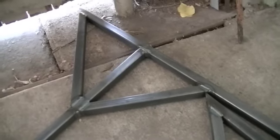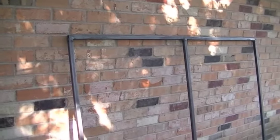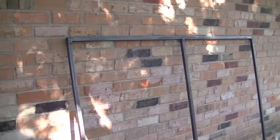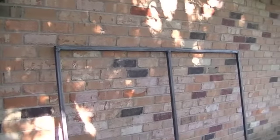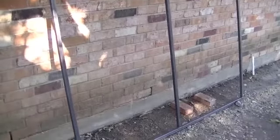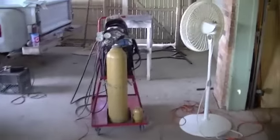We'll be ready to mount the fabric onto the perimeter frame. I'm actually going to use some fabric we had laying around instead of something like a thin 22 gauge sheet metal. The reason is that sheet metal will actually heat up in the sun and radiate heat down on you while you're sitting on the tractor. Plus, using fabric is just going to keep it light — the whole key is to keep this as light as possible so that one man can take this canopy on and off as needed, so you can mow underneath trees and then put it back on for the open pasture. I need to go get some paint and then we'll get ready to mount the fabric.